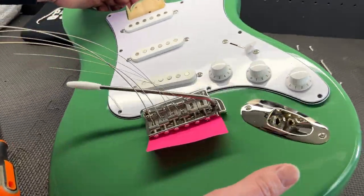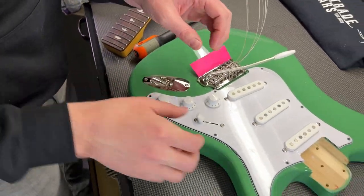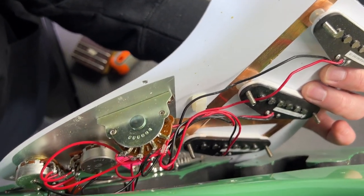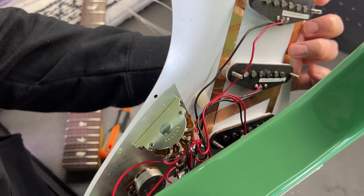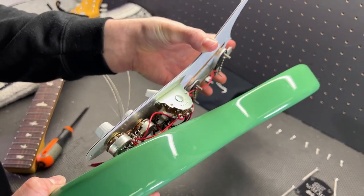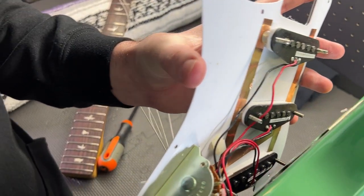It's like they don't want us to look. The lead wire is so short. Wow, that is a short lead wire. I mean, you couldn't service this guitar if you wanted to. All right, so we have some Korean-made Alpha pots. Then we have the 635JM single coil pickups in each position. Does seem to have a treble bleed circuit. But this lead wire from, what is it, I guess it's to the input jack, is so short that I can't flip this up beyond here.